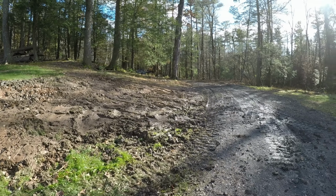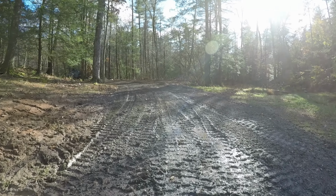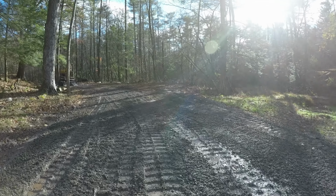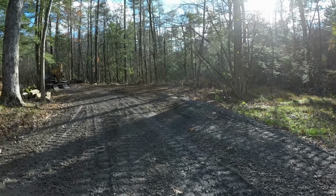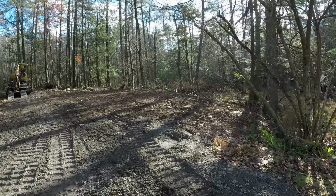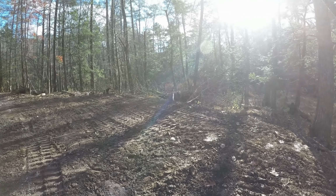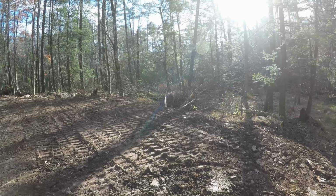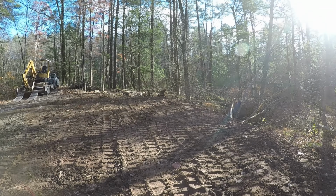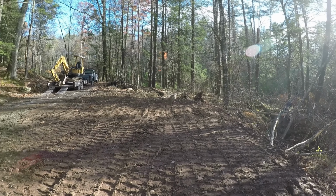So the only other spot was way down here. I put in almost 100 feet of schedule 40 4-inch PVC, and then did a row of, I think I got 7 high capacity chambers in here surrounded by gravel. So this seemed like a much drier spot. I trucked in a few loads of dirt to cover this. So this should last for a long time.